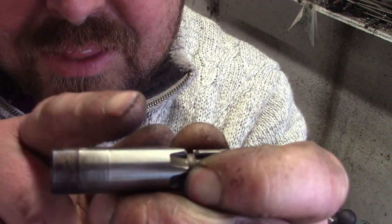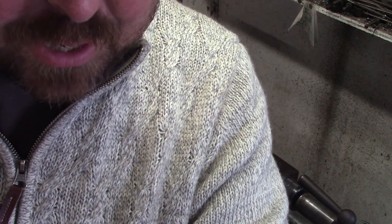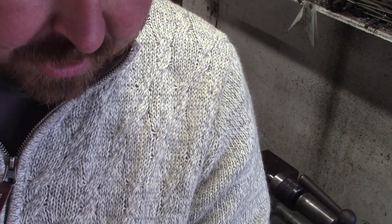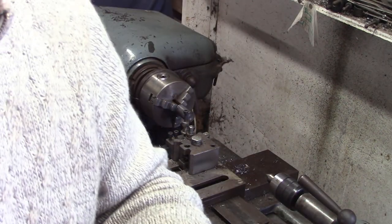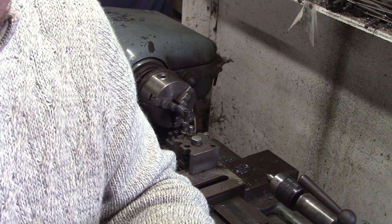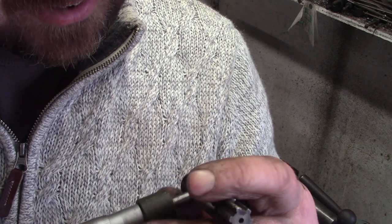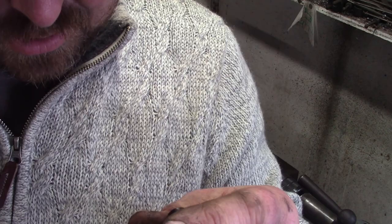You know, we got to get the bearings there and there, and the gear's got to fit on there, which is a half mil bigger for the interference fit of the bearing. I mean, that's a press fit, isn't it? And it wants to be a good solid press fit, because it's taking that tremendous power coming out of the 52cc engine belting along. 55cc, sorry. Okay, so I haven't actually measured this yet. Perhaps I should polish it first.